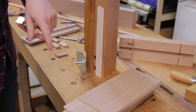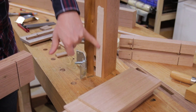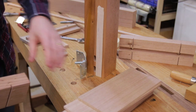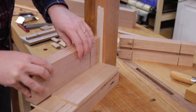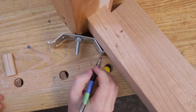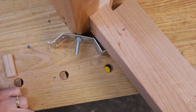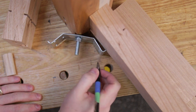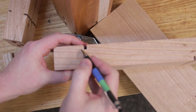This is where it gets a little bit tricky: figuring out where to actually cut the kerfs in the apron piece, which is why I recommend doing a test piece first. I've put a piece of masking tape and drawn a line representing the outside edge of the apron. The kerf-mount bracket is attached to the leg in its final spot, and I've got some spacers that raise me up to the same level as the bracket. Lining the apron up with that line and squaring it against the leg, then sighting down, the kerf ends up being about 54 millimeters in my configuration. I'd recommend starting maybe a millimeter further away — around 55mm — because if it's not quite right you can always widen the kerf, as long as it's not below your minimum.